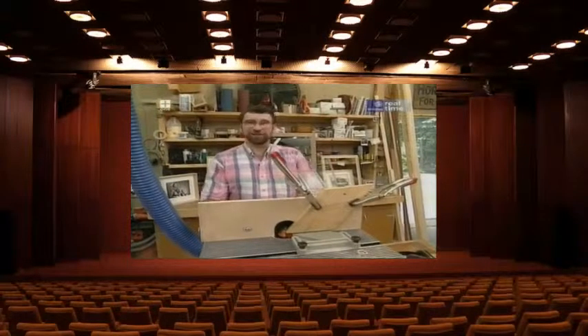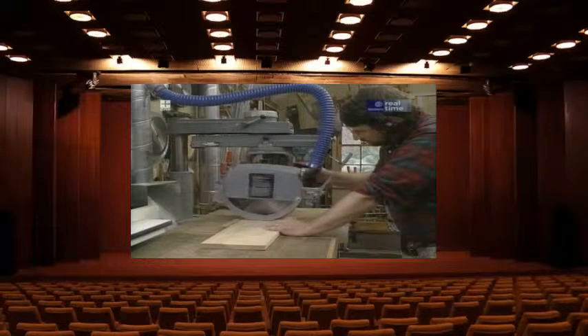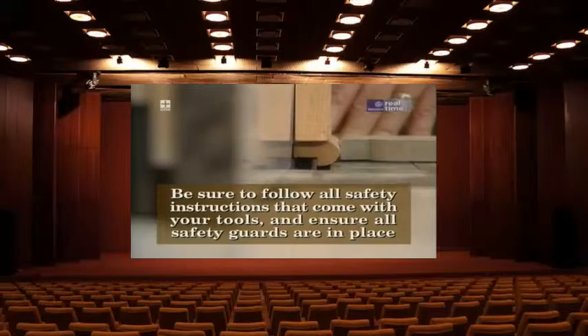While the glued frame dries, here's how the molding for another frame was made — a half round on the front and rabbeted on the back. A router shaper is used for the profile. Before using any power tools, a safety reminder: read, understand, and follow all the safety rules that come with your power tools, always wear safety glasses, and where applicable, hearing protection. The front half-round profile uses a multi-profile bit that makes combinations of all different profiles. To make the rabbet in the back of the molding, a stacked dado head cutter is set up with an auxiliary fence that comes over the cutter a little bit, and feather boards hold the stock in the correct position.